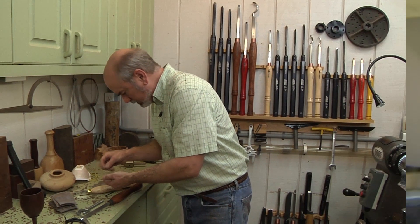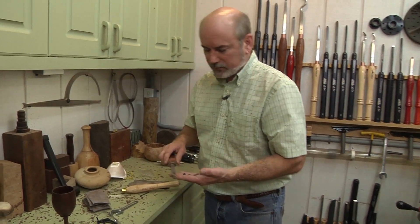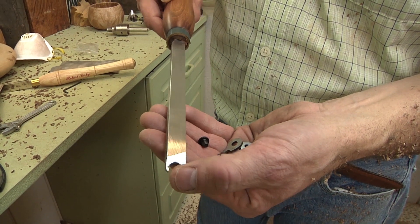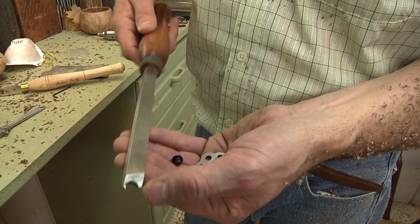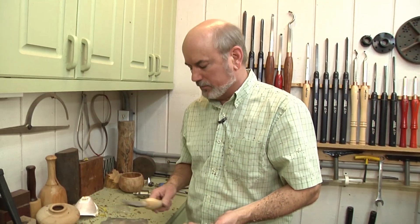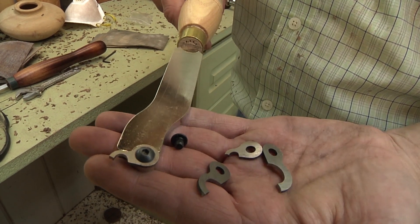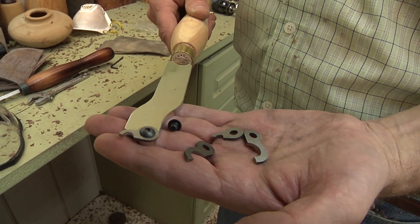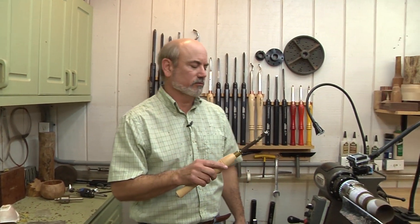So I'm going to introduce you to a neat tool. I'm getting my stuff ready here because ring tools are very interesting tools. I'll start off with this — this is my old ring tool. I think it's made by Hamlet and it is a wonderful tool, but really you can only make one size ring, and I kind of botched it up. I didn't pay attention to the instructions on how to sharpen it, so it really cuts well this way but the other way I screwed it up and I think I'm kind of running out of metal. So I went to my local Woodcraft and picked up a Robert Sorby ring tool, which is very cool because I've got one, two, three, four different sizes of rings I can make. That is neat because I don't have to shape the ring freehand, so to speak. It's a neat little setup and we're going to go with this size — I could tell you what that is but I think it's like a quarter inch.